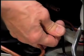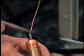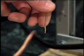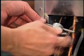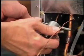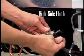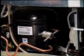First, cut out the high side at the compressor discharge and the hot tube discharge at the dryer. The cap tube is too small for a tube cutter, so etch it with a file and break it off. Make sure you haven't collapsed the opening. Connect a process tool to each end, or if you use sweat-in valves, be sure to remove the Schrader valve stems before sweating these connectors on. The heat from this process will ruin the valve seats. Leave these stems out during the flushing process to provide greater flow through the system.